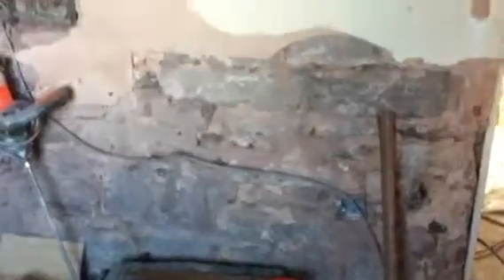Some evidence of the foam coming out of the cavity there. This was the old back wall of the cottage, which we think was a lot older than the 19th century front — they're probably built on some ruined stone walls. So again, parging and the base plaster coat have been taken right down to the concrete slab, so our new concrete slab is the airtight layer.